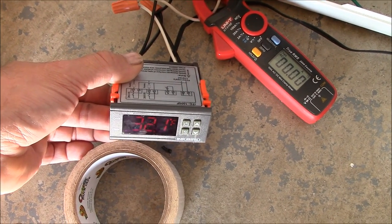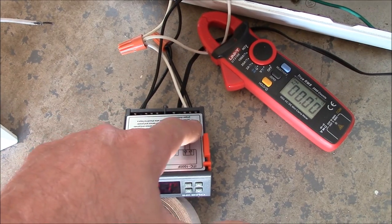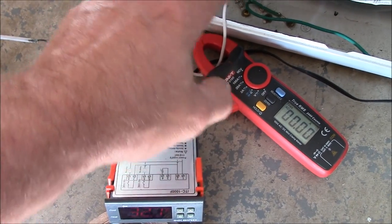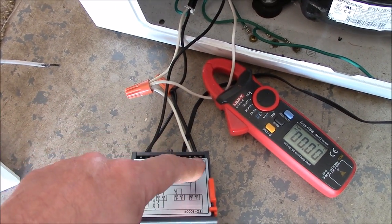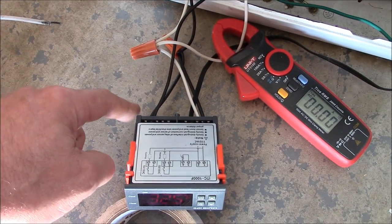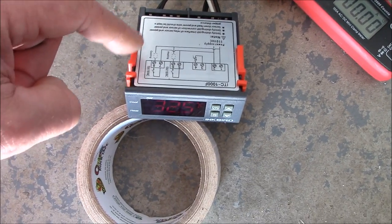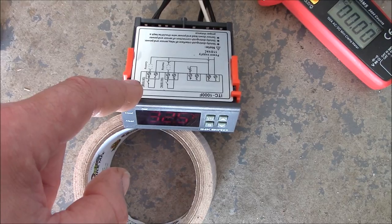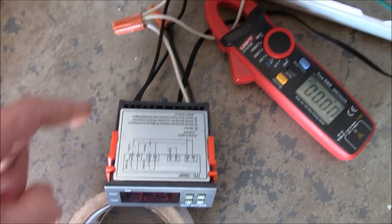$13 on Amazon. The way I have it wired: line in hot goes here, neutral goes here, then all the neutrals are tied together for the compressor — three wires coming out of the compressor here. I tied the neutrals together, and then the hot feeds over to this pin on the far left, and then this acts as a switch. It's marked cooling and heating — you don't use heating for this application, just cooling.